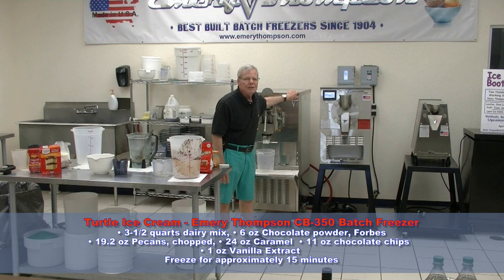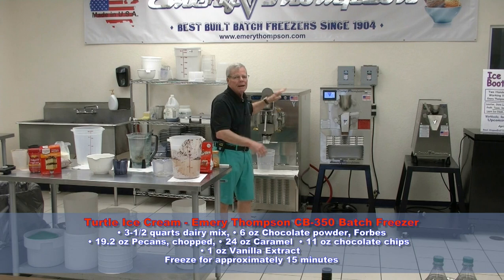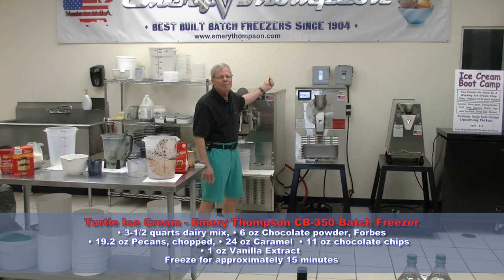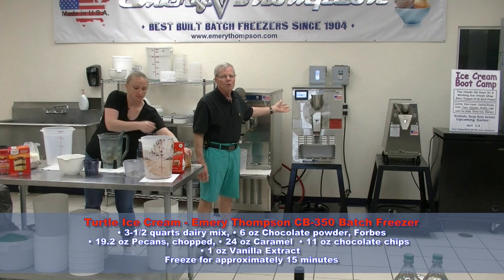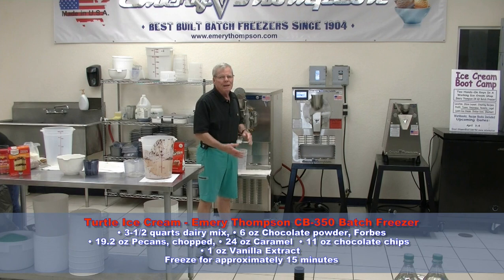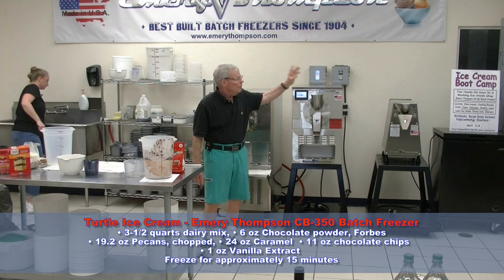So instead of closing down your store for a week, tearing up the walls again, running the line, and then repatching it back up so you can put this machine in, the wire that's feeding this is more than ample. All the electrician has to do is disconnect this, connect it to this with the kill switch in the back, and you're good to go. So maybe it costs you $80, $100 more in wire size to be ready for the future. It's such a simple thing, and we just saved you several thousand dollars of sheetrock people and painting and closing the store, the whole works. So if you know you're going to need this thing and you're doing a fresh start, run the electric lines for this and then don't use them.